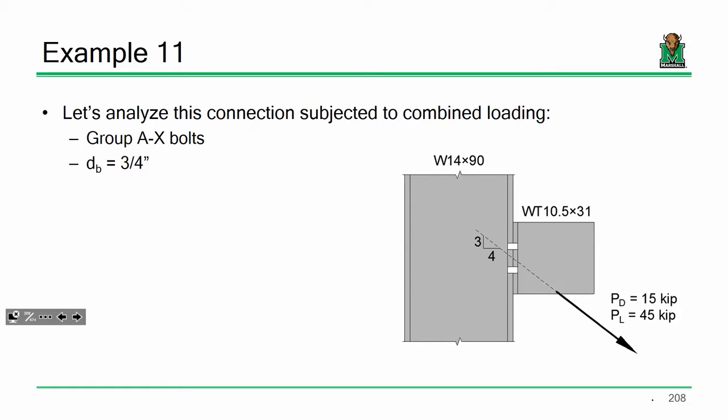Actually, it helps a little bit because you're going to have less shear. You're going to have less tensile stress because you've got some of that shear. So in many cases, it helps. There are many instances, though, where combined loading hurts it.